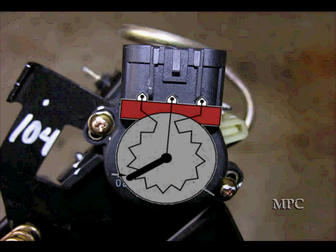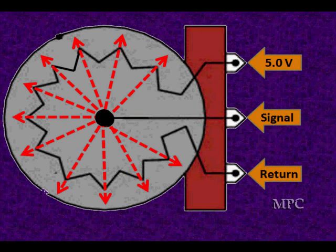This position sensor works like we've had before. It's going to move around and pick different points in the resistance. It's got voltage at one end — five volts in our case. The signal is the pickoff, and the bottom is the return. All these arrows mean we can move this around and it picks different voltages off at different points.